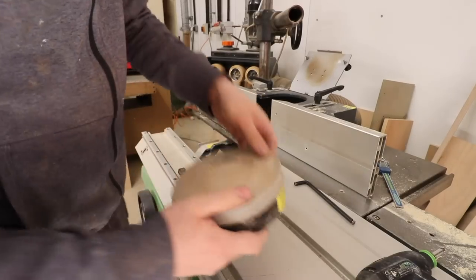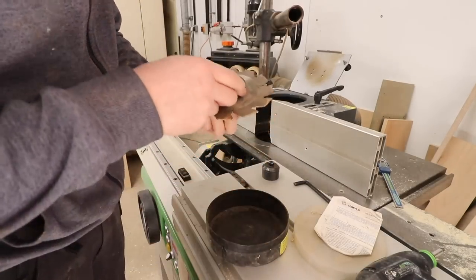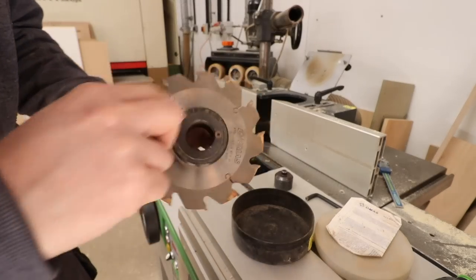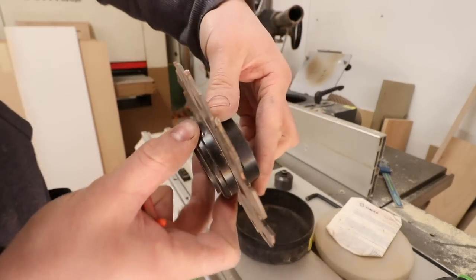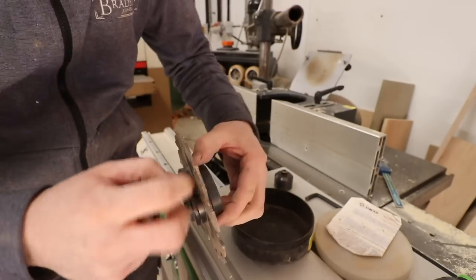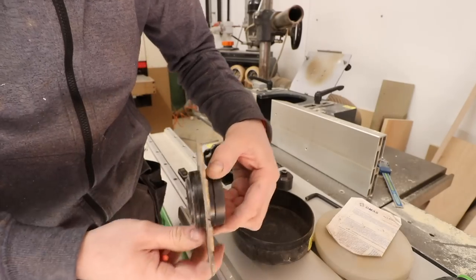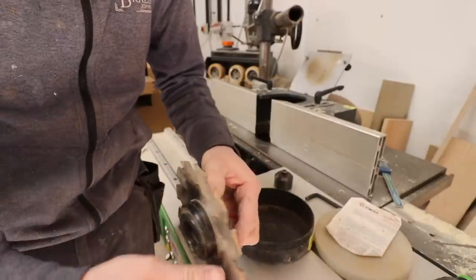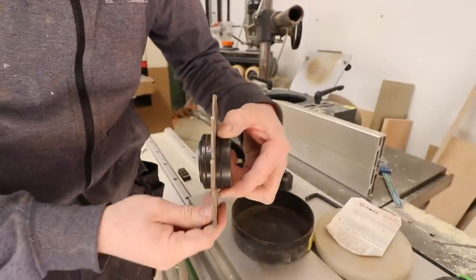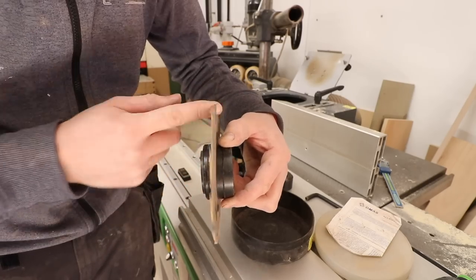Blow the dust off the old wobble saw. I've not used it in about 10 years. So this used to be our only form of grooving where he used to work. It's basically a saw blade on a set of tapered cams, and as you turn the saw blade against the cam, it sits on an angle, and it'll do a wider or a narrower groove depending on how much it wobbles.